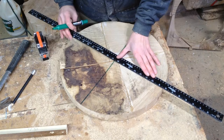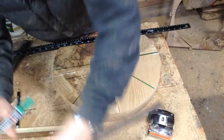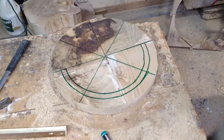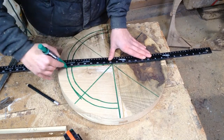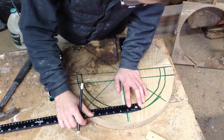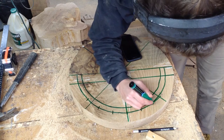I already had the X diagonal marked as my center before I cut the circle, which was helpful. I could easily find center and then continually added other marks — not only for setting up the rails in the back of the chair but also for carving. The half-circle I drew is where the rails are going to be, about an inch and a half off the back, and I marked center vertically so my first back rail would be where that center line and back arc meet. I originally marked seven positions but only ended up using five because the seventh mark would have been too far out. I made seven rails but only ended up putting five in.